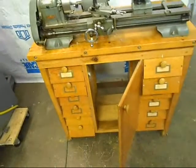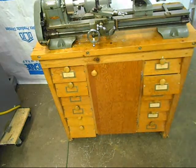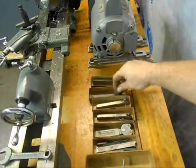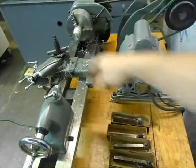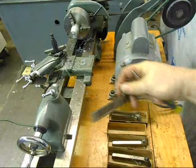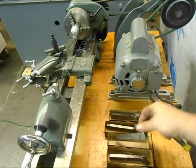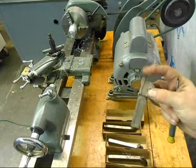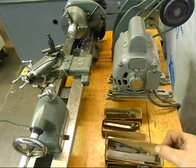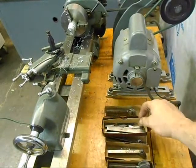It's got a nice cupboard — the cupboard's got about a dozen drawers and a large open area. Some of the additional tooling: it's got tool bit holders, this will take five-sixteenths directly in the tool post. You can also use the tool holders that came with it — they're all badged Craftsman and all in great condition. This is a right hand turning holder, a left hand straight, a cut off holder, and a knurling tool. It's also got a bunch of bits including a cut off bit — the actual tool that engages the workpiece for cut off — and a bunch of other miscellaneous tools.